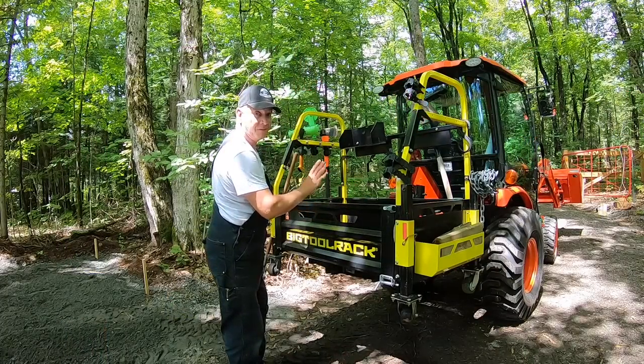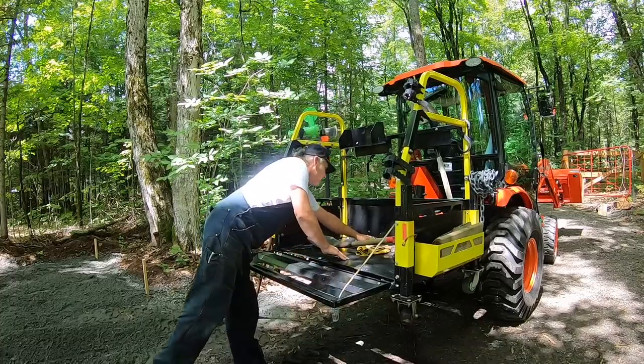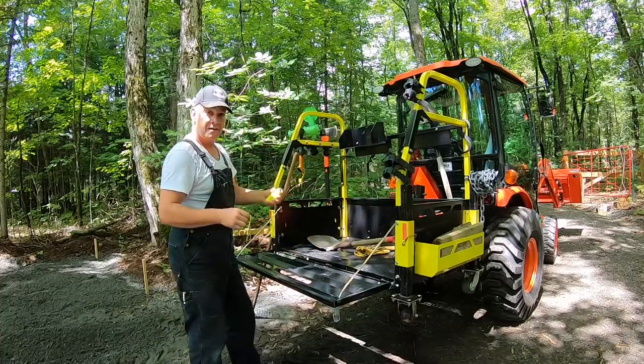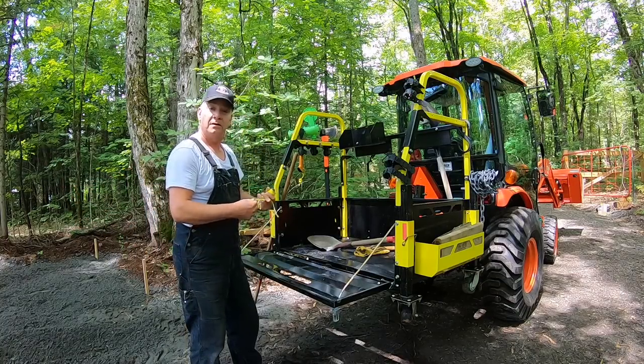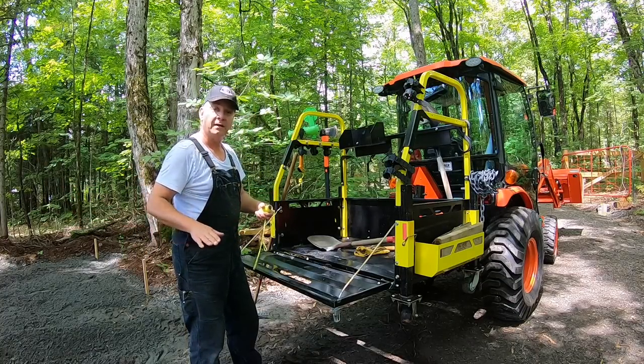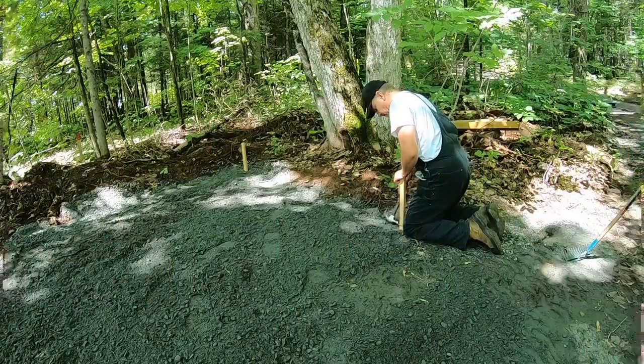I think I'm pretty close, if I'm not pretty much there. So what I'm gonna do, I'm gonna grab a little string, I'm gonna tap a few nails into the markers on each of those four posts, draw the string between it and see if I can level it out, or if I'm really still short of gravel. I think I should.